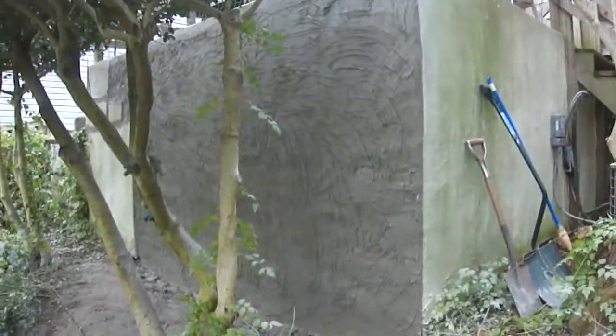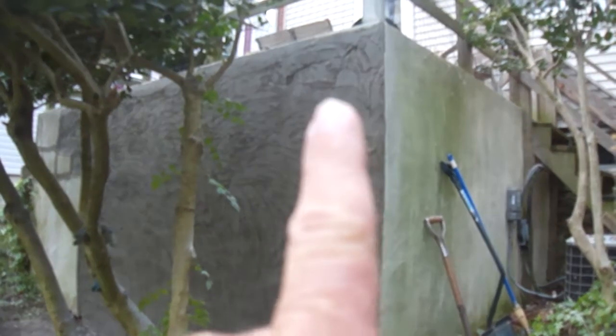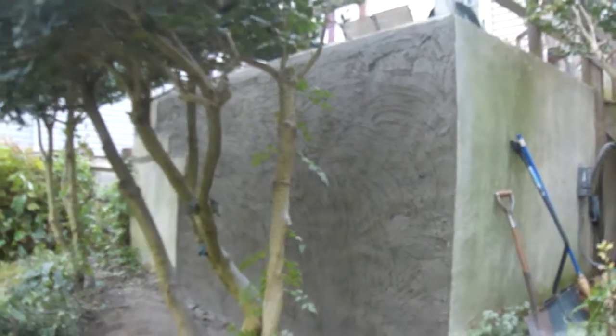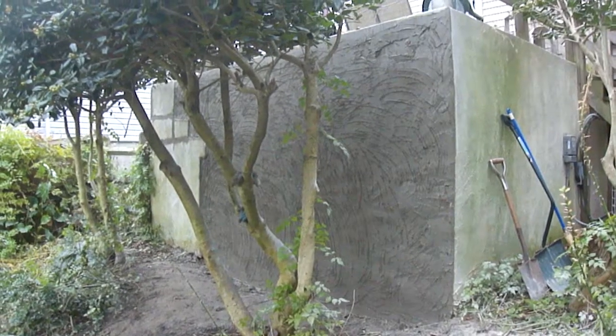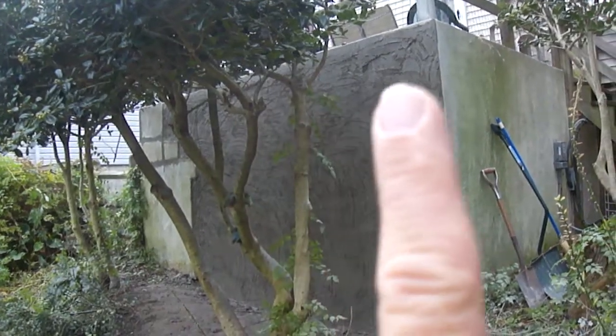Where it's cracked to is right here, and that's where the crack widens. I didn't check those blocks underneath there, and I showed you yesterday there are some rotted blocks. He didn't remove that one at the top. I left the first course of blocks in there — I could have jacked that up and then put the blocks in. Didn't put a lintel in there either. They need a lintel right up there to support the top of the porch — a concrete slab porch with old concrete blocks in the walls.